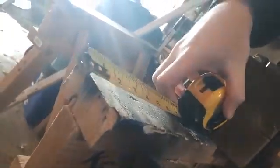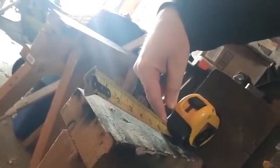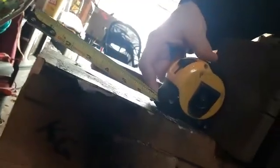Of course, it just says it's the best one, and then this doesn't have it. But it'll actually have a measurement, usually under the little clip. It'll tell you just some random measurement. It'll probably say 3 inches and some odd, so 3 1/4, whatever. What that's telling you is the width or the length of the tape measure itself, so that you can butt up against something inside and know that, hey, I see 7 inches plus the 3 1/4 that is the tape measure. So that's what that number indicates.